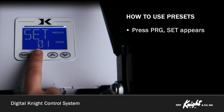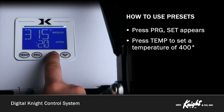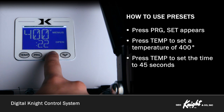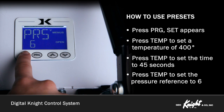Set appears. Use the arrow keys to select Set01. Press Temp. Set the flashing temperature to 400 with the arrow keys. Press Temp. Set the flashing time to 45 with the arrow keys. Press Temp. Set the flashing pre-press time to 00 with the arrow keys. Press Temp. Set the flashing pressure reference to 6 with the arrow keys.